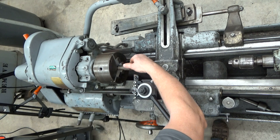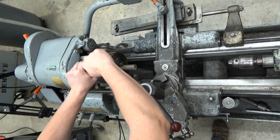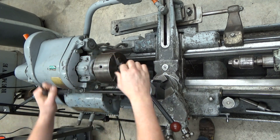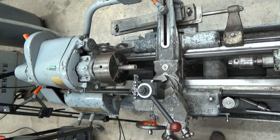But let's assume that we're going to be doing a basic facing operation here. We put our stock outside of the chuck and get it tightened up. If we want to get it a little bit tighter we can put it into the other holes and get it snugged up. You can see the end of this stock is rough — it was cut with a bandsaw and it's in need of truing up.